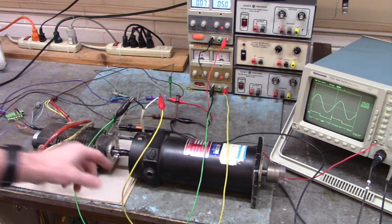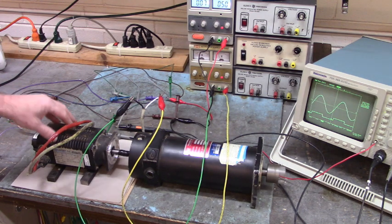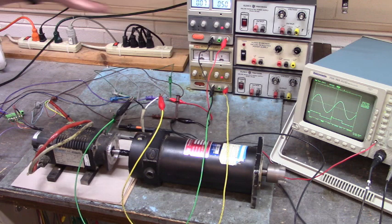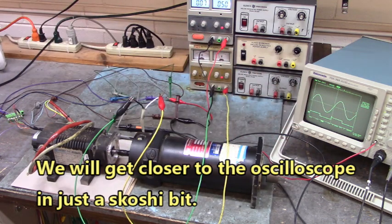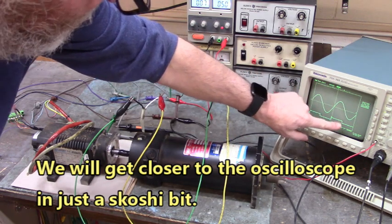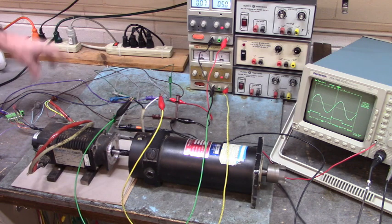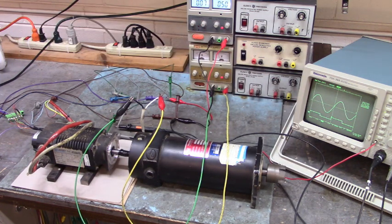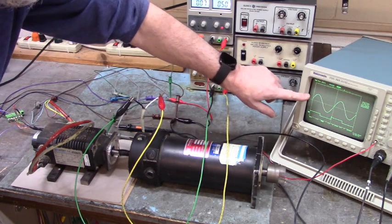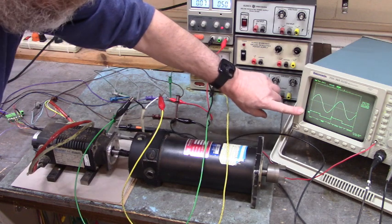I have this DC motor right here rotating the shaft of the servo motor, and it's generating a voltage out of U, V, and W — it's generating a sine wave, and that's what we see right here. Now the hall effect feedback is this waveform down here. So we power up the encoder with five volts, we look at U, V, and W with the oscilloscope, and we look at the hall effect feedback with the oscilloscope. Here we're on channel one looking at the UVW sine wave generated by rotating that motor.